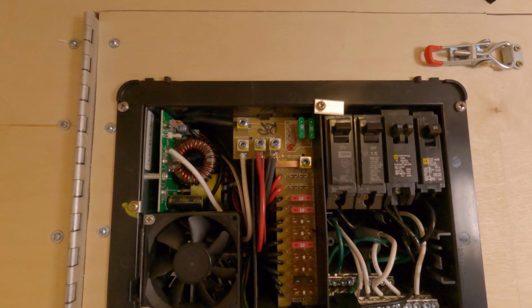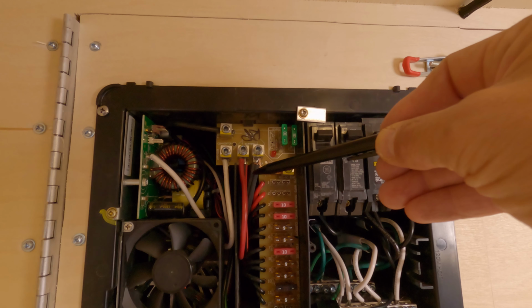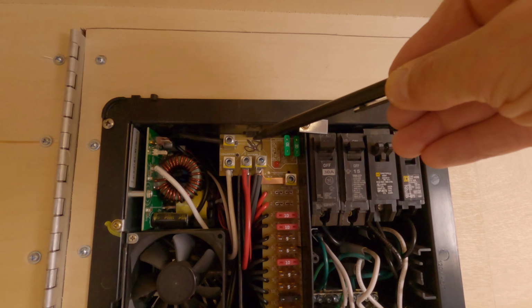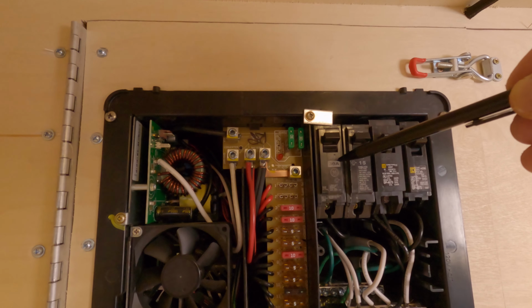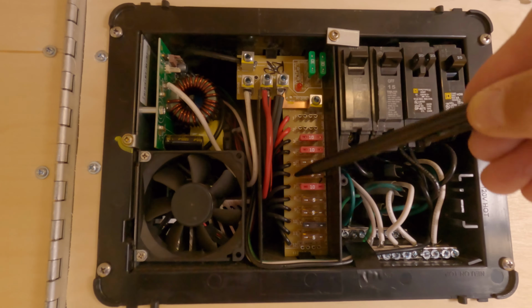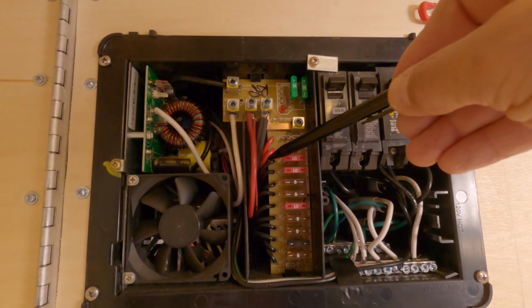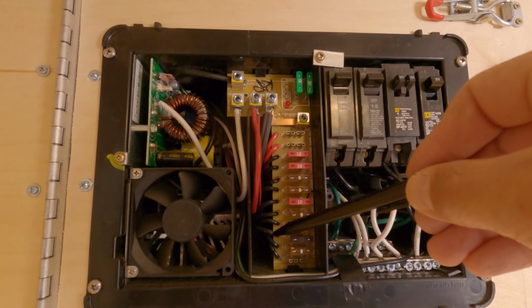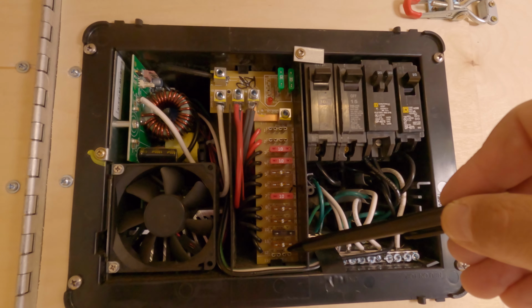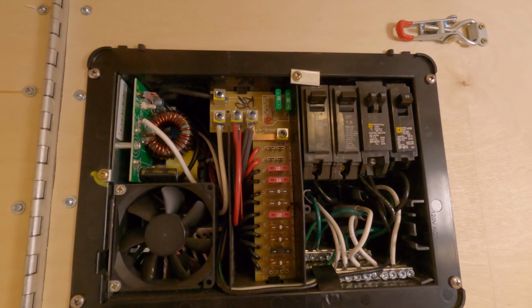All of our 12-volt electrical needs come through these 2 terminals right here. So we have battery power positive coming in, battery power negative. This is also where we get our charging of our batteries, whether solar or through the PD system. Really quite elegant. So this is our 12-volt distribution channel here. These red wires are 12-gauge wires. They're for 20 amp circuits. The black wires, I believe, are 14-gauge. And they are for 15 amp circuits. And so you can see I have various circuits here. I have not used either of the higher amp circuitry.